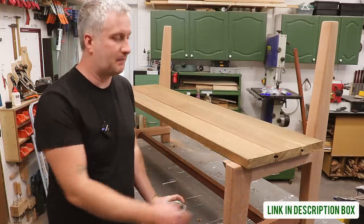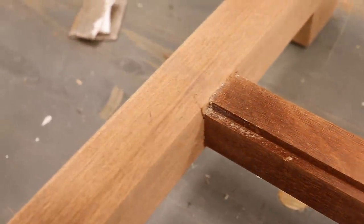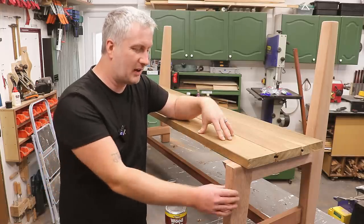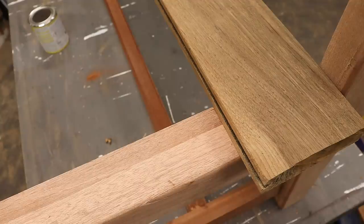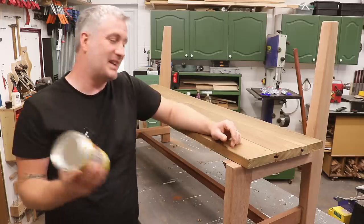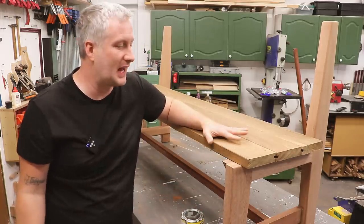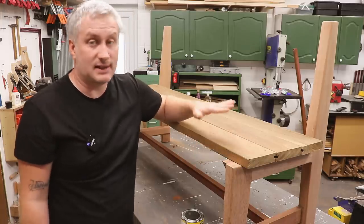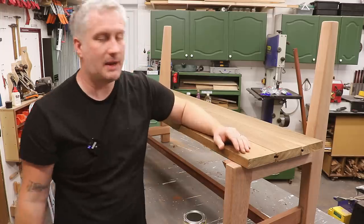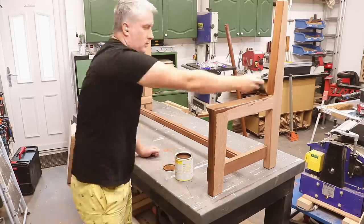I've bought a stain to apply to the frame for a few reasons. Firstly, the wood I've used on the frame doesn't all match — it's not all the same species so some of it is darker than others, and the stain will make everything match a little better. Secondly, I don't think the golden colour of the teak is going to look nice against the reddish colour of the hardwood frame. Thirdly, this hardwood frame isn't going to be as durable as the teak, so the frame could do with extra protection to hopefully make it last. And finally, because I've used half lap joinery with pieces running perpendicular to each other, sealing it with a stain will limit moisture absorption and the amount of expansion and contraction the wood can do.